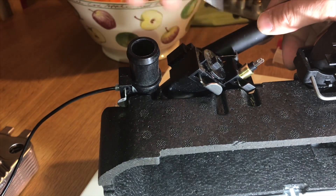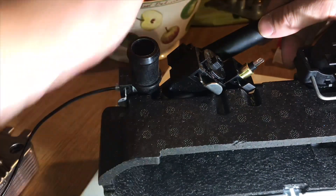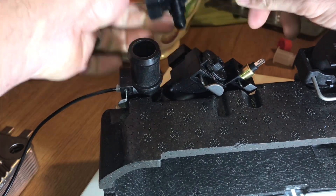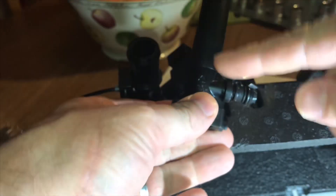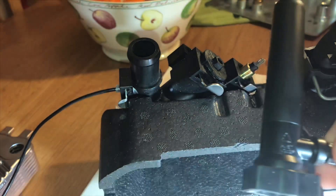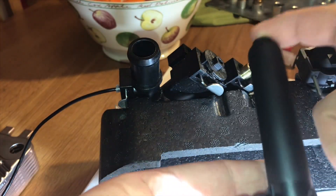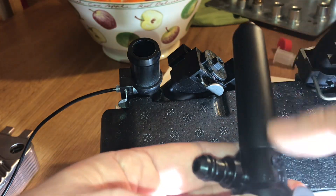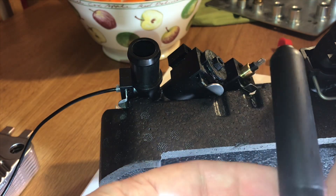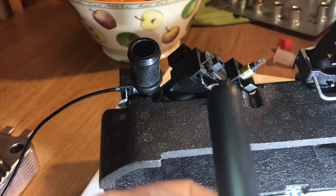The next thing on the 050 and the 200 range is a built-in shock arrestor — one clip comes out. If you find that the hot water tap is spitting at you, drain the boiler down, drain the cold water down, and refill it. When you refill it, you're recharging the shock arrestor. This shock arrestor is designed to absorb water hammer and pressure, allowing water to escape should pressure build up. It saves you fitting one externally and protects the pump and plastics.